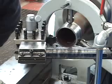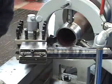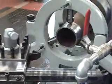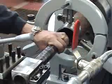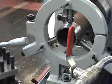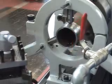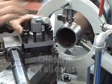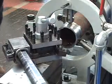Final cut. Now before I switch, I'm going to rotate my tool post and move my next tool into location. This will allow me to cut the chamfer on the outside edge — I don't want any sharp edges. I'll turn the nose of the tool at 45 degrees and just touch it in here.